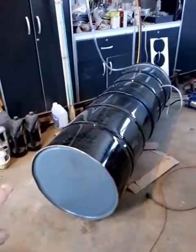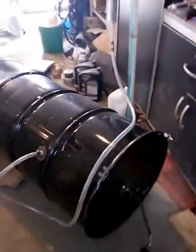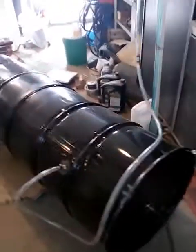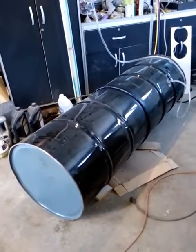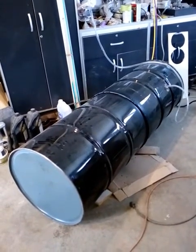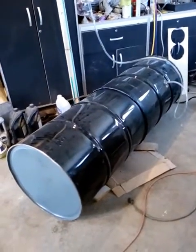The bottom will be cut out. This is the bottom. It would be cut out and there'll be a bellows put in there. So it moving back and forth, we're not so worried about it. This end over here will be the head end, so we'll cut out a spot for the person to put their head, and there'll be a nice gasket around their head. So we're hitting 3.5 times the maximum working pressure right now, and it's holding its shape. Still got a couple of centimeters to go. That'll be 140 centimeters. Our goal is 160 centimeters.